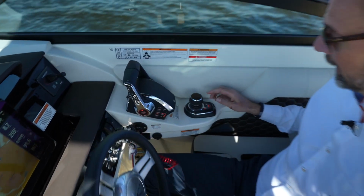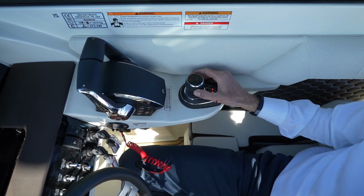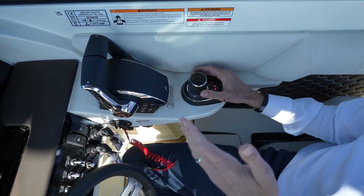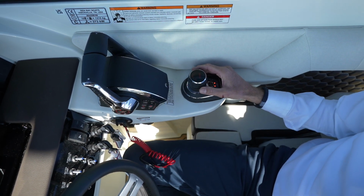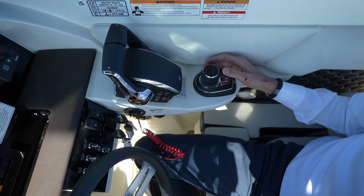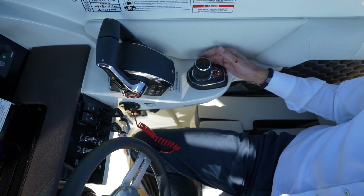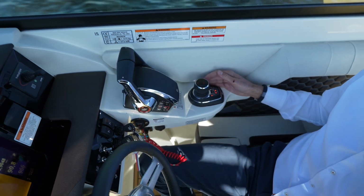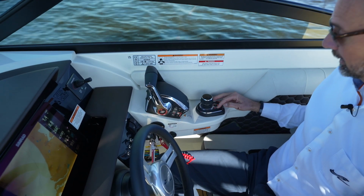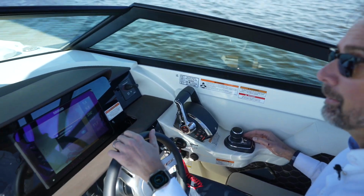There's another button, I think it's called track, which is this one. Before I carry on, by the way, what I can also do, you see these small lights here. If I do like this, the boat goes 1 degree to starboard. If I do like this, the boat goes 10 degrees to starboard and keeps that heading again. So this is also used in the autopilot setup. And this, let me take it off autopilot because we're coming into an area where there may be other boats.